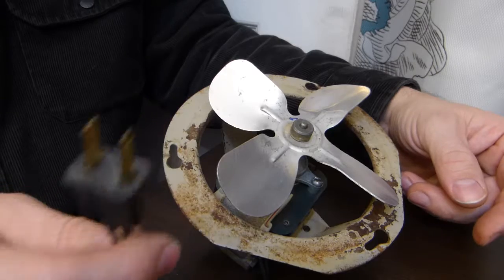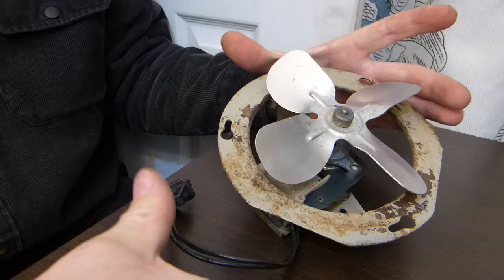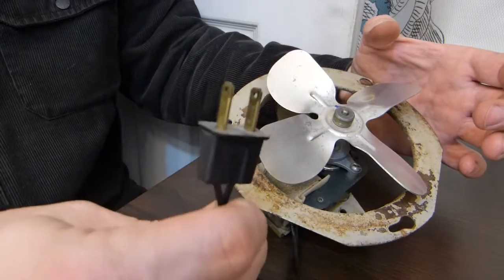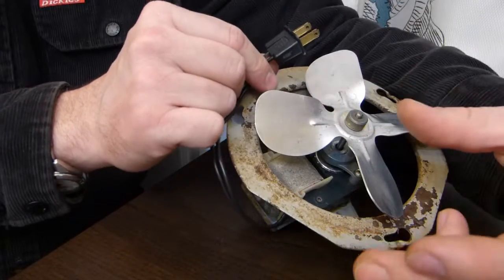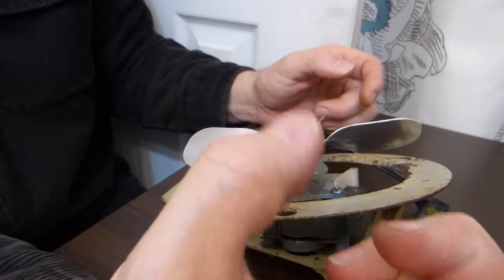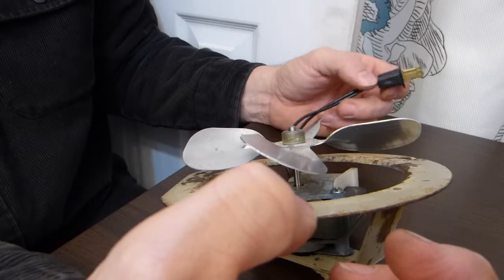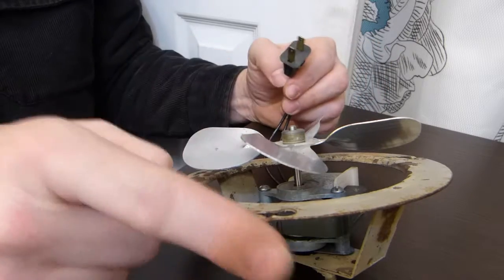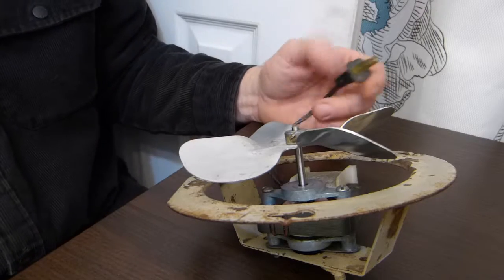The third reason is electrical. The geometric arrangement for a new fan box is such that the exhaust port and the electrical wiring point on it are mirror opposites of each other. So if you make the new one work with the exhaust port of the old one, with or without complete replacement, or with or without a 3-inch to 4-inch transition, then the electrical connection is going to be at the wrong spot. It's going to be about 6 inches, something like 15 centimeters, too short.